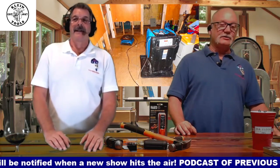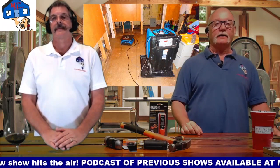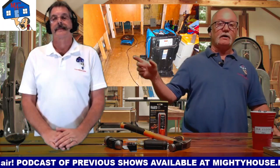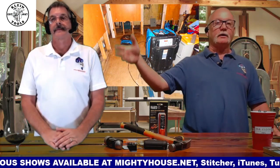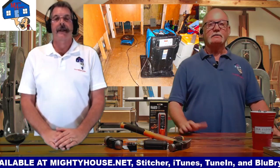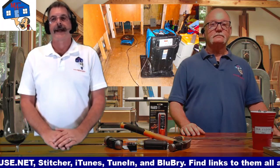Yeah, they are. So if you've got a basement like this that has the older framing and stuff, you may need to cut that out and get rid of it if you can't get it dried out fast enough. But if you call these companies out that have these blowers, a lot of times they'll just drill holes in the baseboard, like Rich said, set up the tubing and blow air through them and dry them out pretty fast. The key is if you can get to it soon enough. The key is to do this within like 48 hours.